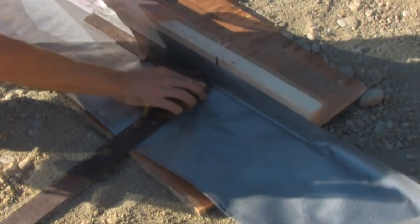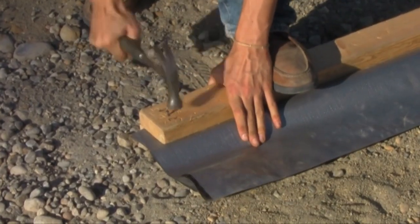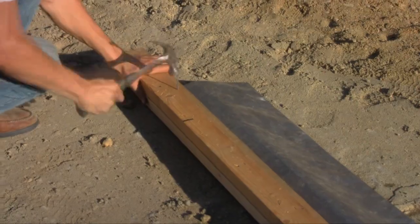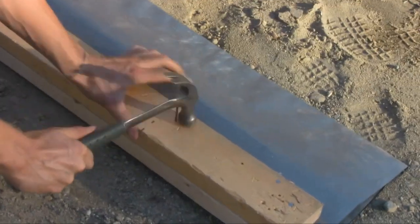Rotate your 2x4 90 degrees and cut across with your square. Then sandwich the alignment tab with your second 2x4, placing two nails at the base and two nails at the top of our Fast Tube. Then nail off the remainder of our column every 2 feet, but place the nails one inch away from the Fast Tube to better grip the alignment tab.